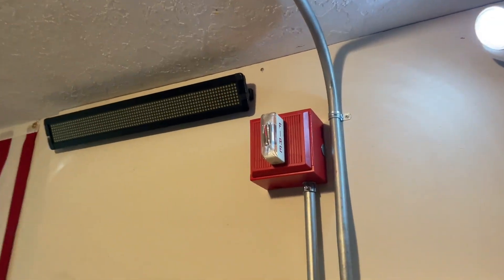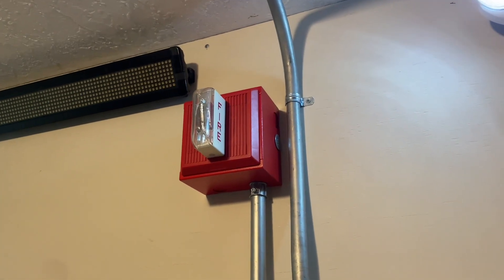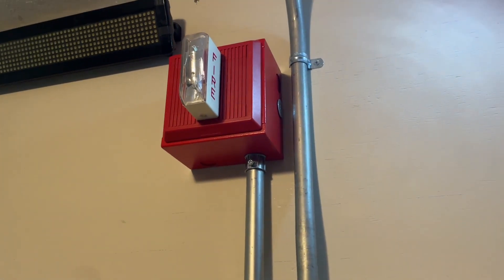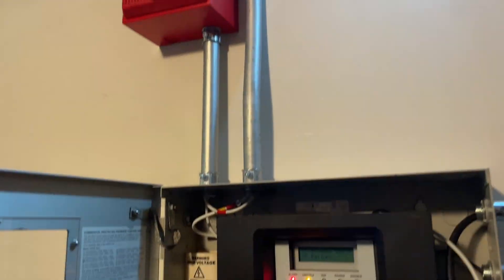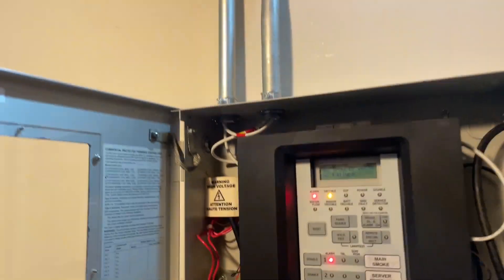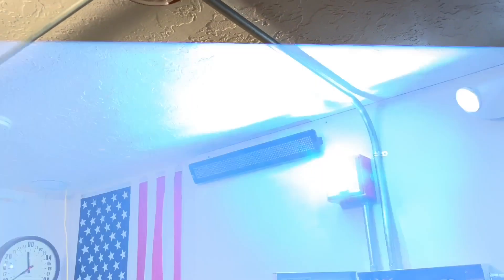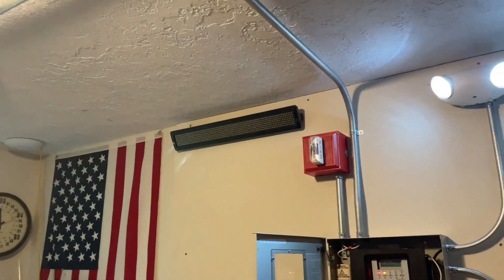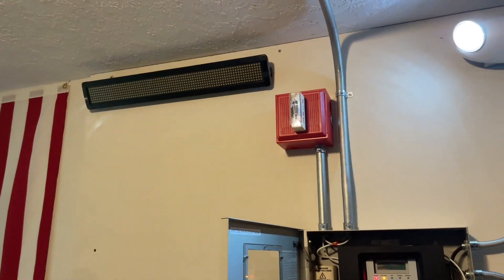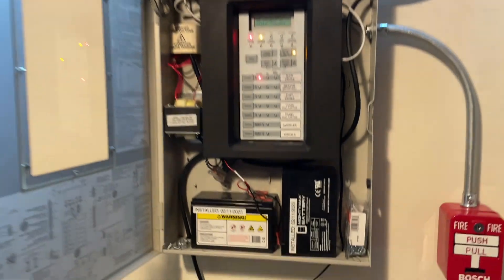You can hear how the tone on the alarm changes because we're not in FWR anymore. Signal silence. It does sound way better when it's not in FWR. For those of you who don't know, the DC bus does change a bit differently when it's on AC versus directly on the DC batteries.